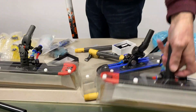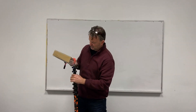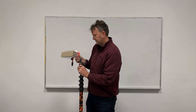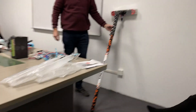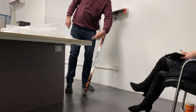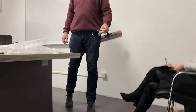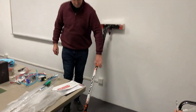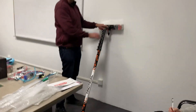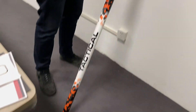Balance is a rubber end cap. What we found is that guys would actually break their poles because they were leaning them against buildings, and because the pole is round at the bottom it would spin, the pole would fall over, somebody would tuck a tube or knock it. So what we did is put two feet on the bottom — there are three feet total, but two that are on the ground, parallel to the wall. Even though you have a pivot which could make that unstable, because you've got the feet there, that holds the brush stable on the wall.